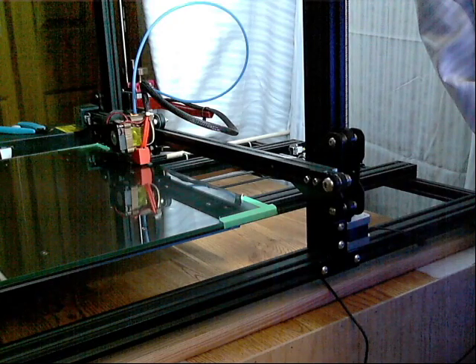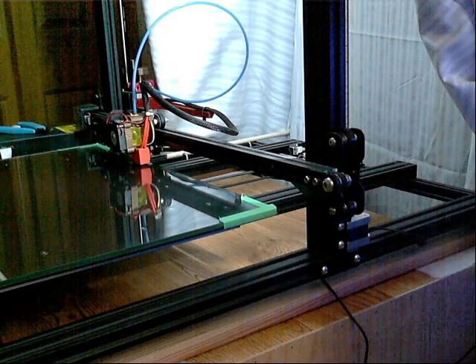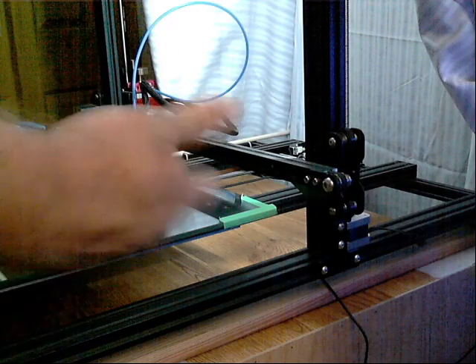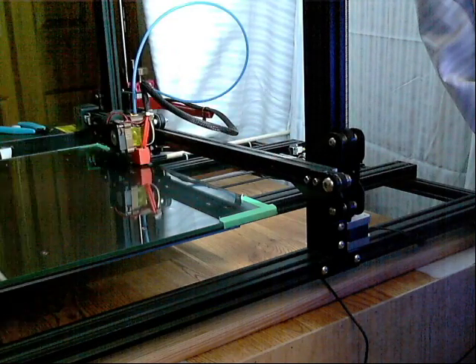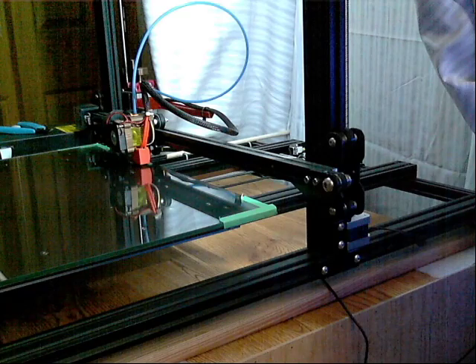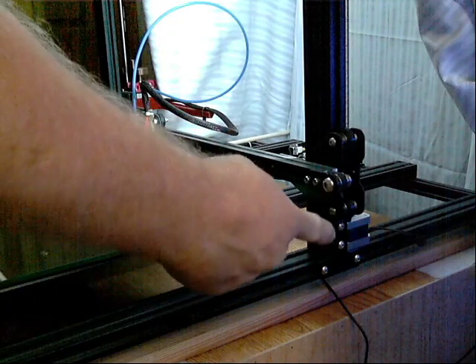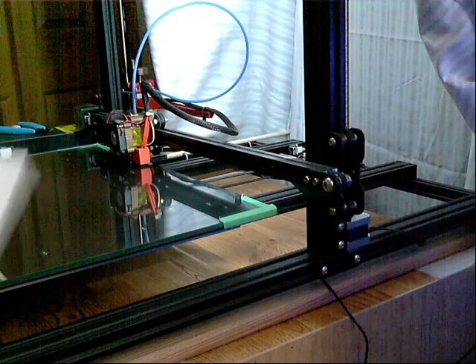I don't really know what to do. What I do now — my bed doesn't change. The springs on this bed are so stiff that the bed doesn't move; my bed is perfectly flat. This is what changes. So why should I change my bed every time? I don't really feel like unscrewing the coupler every time. Knowing that these stepper motors are not geared — they're just electronic pulses — here's how I home my machine and level my bed.